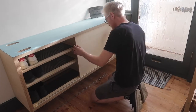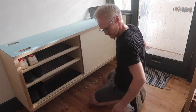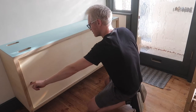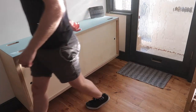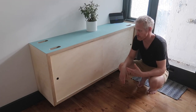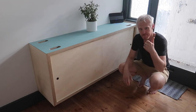Lastly I fitted the newly made sliding doors. I find that simply laying a polished length of round steel bar in the bottom groove makes the door slide super easy, since the friction is now between wood and metal rather than wood and wood. And with that the unit was done. Thank you very much for watching - please do remember to subscribe and send it around to any friends that might enjoy the video. Until next time, goodbye.